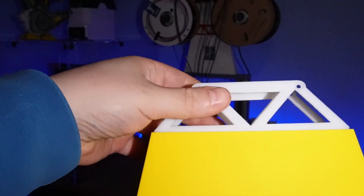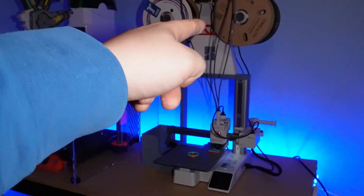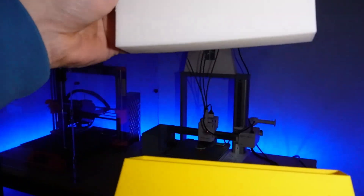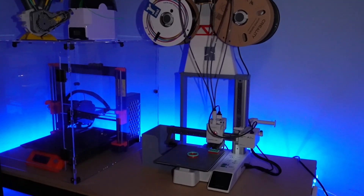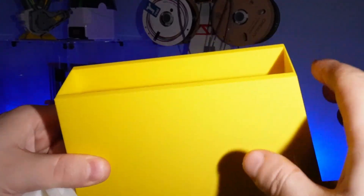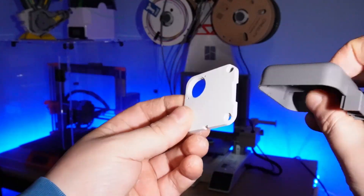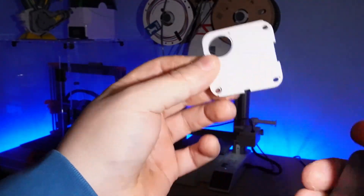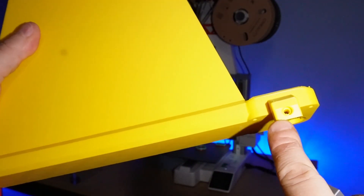The top portion is this one — you can take this portion out. I designed it this way so that if you need to take your AMS system out of the gantry, this portion is fixed to the AMS system, and you just take it out and your AMS system is free — except for the PTFE tubing and the AMS power cable. There is a gap of around 5 centimeters, and once you're done removing the AMS system, you can just push it back in. You take this one out with one bolt, then the part underneath with three bolts, and fit the new part in its place with three bolts and one bolt in front. It's really rigid and stays on there.